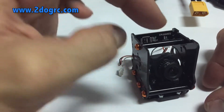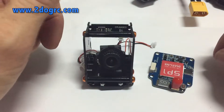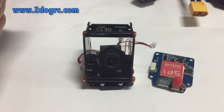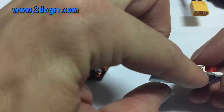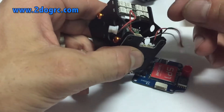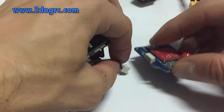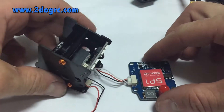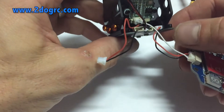On this camera pod we've got our LED lights and our camera, so we've got to power them. We've also got our video transmitter to power. The cool thing about this Diatone kit is there are extra cables included, so if you mess up you'll have a spare set. This connector is a little different — it's got pins in a slot. I looked for the matching connector with pins in a slot, and that's going to be your video transmitter connection, right there.